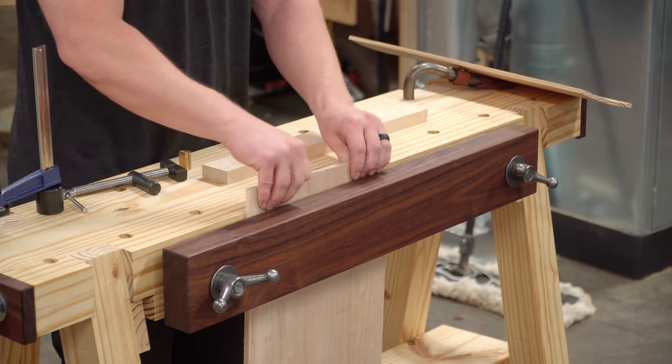You can clamp anywhere on the workbench between the dogs with a bench dog and one of these clamps, getting pretty good clamping pressure — enough to lift the entire workhorse. Last up are the top-down work holding options. This is a holdfast — a tried and true design that's centuries old. The shaft goes into a dog hole at a less than 90 degree angle, and when you strike the top with a mallet it wedges the shaft down in the hole, binding at an angle and putting downward pressure on your material. It's very handy for dovetailing drawer sides, and you can stack multiple pieces to do all your drawer sides at once.